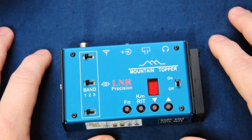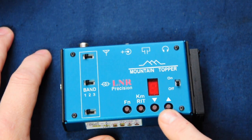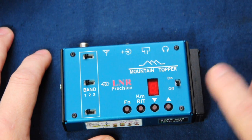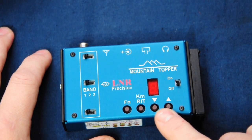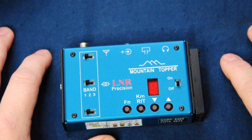On the right-hand side is the basic on/off switch, and along the bottom are four main control buttons. The two right-hand buttons are used to tune the radio, and the whole of the 20, 30 and 40 metre amateur bands are available. If pressed momentarily, tuning moves up or down by 50 hertz increments. If held, it scans at about 700 hertz per second — roughly one and a half seconds per kilohertz, and about a minute and a half to sweep through the CW section on 20 metres. The speed is optimum for covering the bandwidth without overshooting a CW signal.